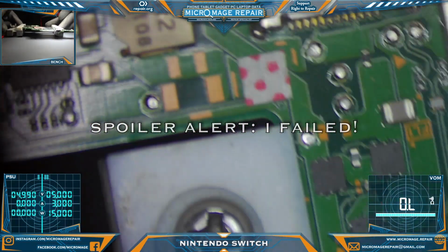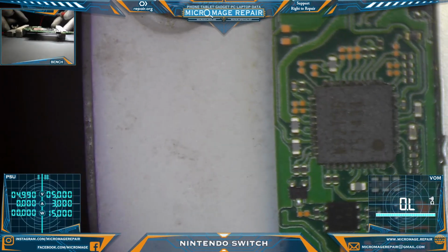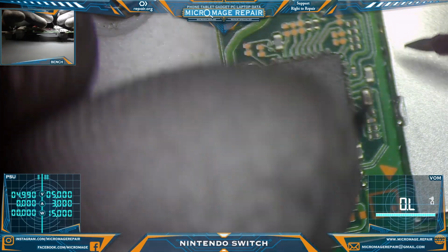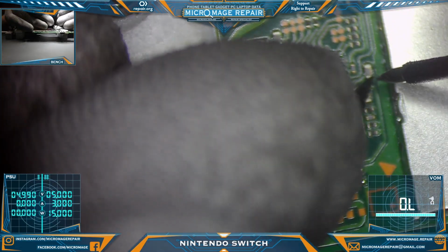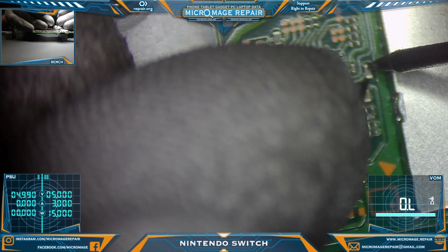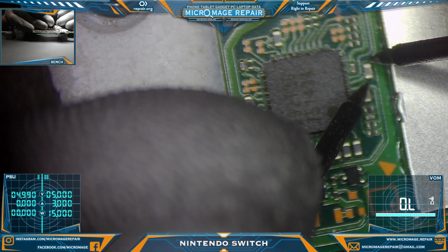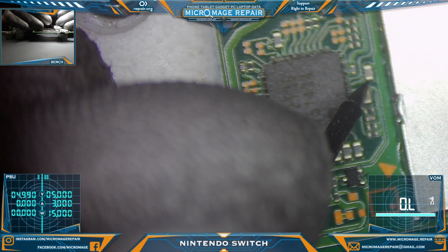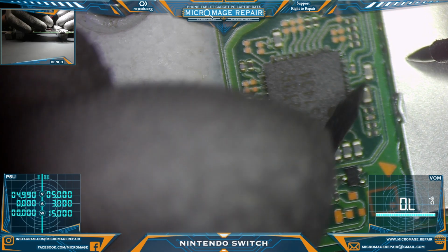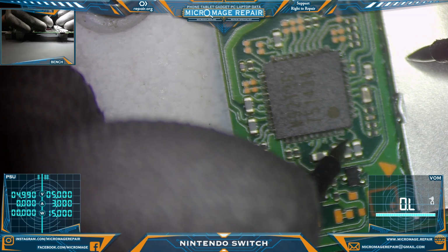We're going to test around the M92T36. As always, we will follow the traces to the chip. We're going to check the capacitors around it, and follow the traces to the chip. In this case, this chip goes through M92T36 and connects over to PI3USB on the other side. So we want to test it and make sure it's good. On this side going to the chip, and it's good. So the rest of them we want to test the same way, following the traces.